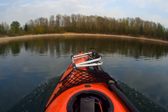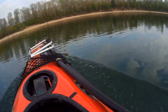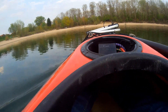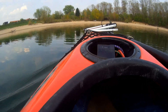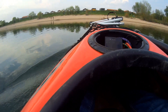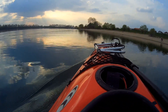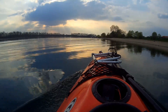On the 4S battery, it seems like the ESC is just underpowered. For normal driving it is okay, but for acceleration it just shuts off because it's too much power for that 90 amp ESC. So I'm already pretty happy with how version 2.0 turned out — it's definitely a lot more usable and more efficient than version 1, but there's obviously room for improvement. I have to address all the electrical issues, and maybe even get a better gearbox, a bigger motor, and so on.